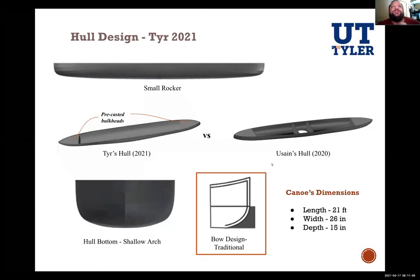If I can ask a follow-up question, how did you manage and prevent the issues that usually come up with cold joints? So basically we do our pour day all in one day. We pre-batch all the concrete, so we're ready to go for pour day, and we do all our pouring the same day. We prevent cold joints from forming by placing the concrete in a fast manner.